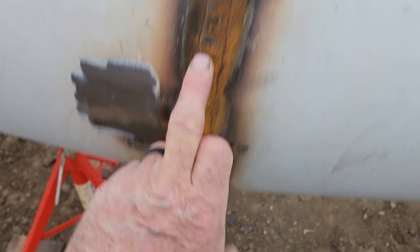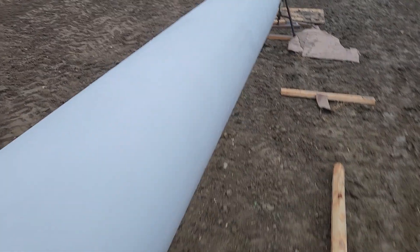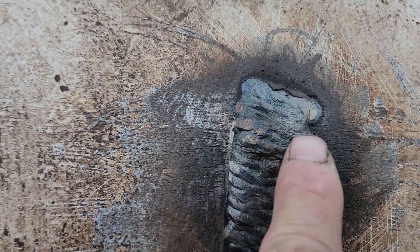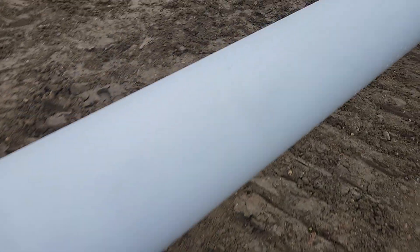So I've got to clean these welds up here and prime them. The paint is aliphatic polyurethane, and I have an aliphatic urethane primer to touch up. What happened was the product came — here are the joints from the factory. And here's another plug weld. They just keep going — it's like they're on these for hours. Anyway, today I've got to clean it up, sand it, and paint it.